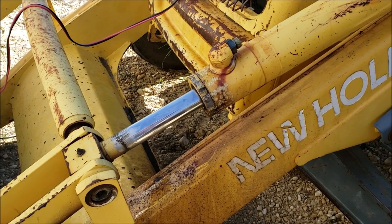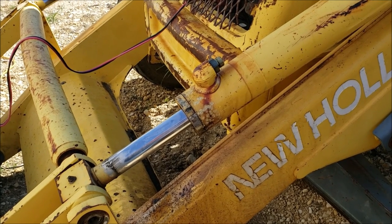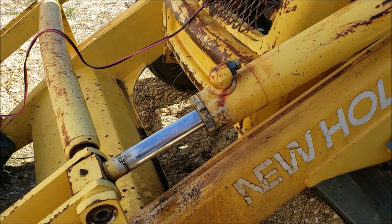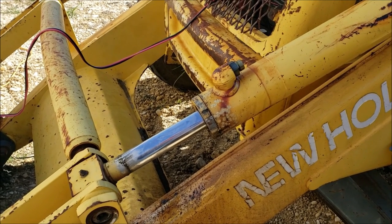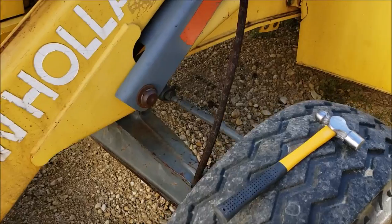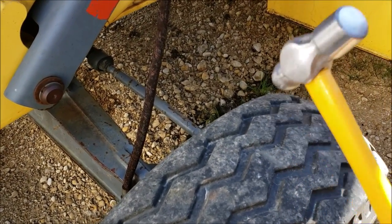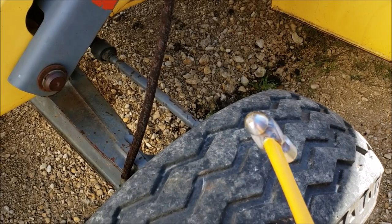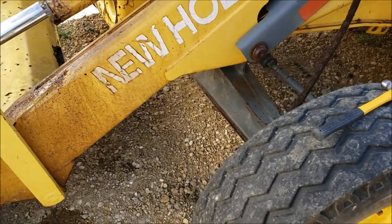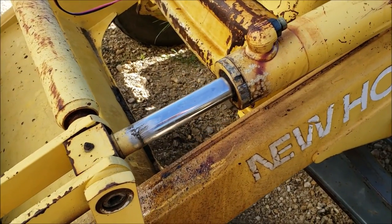I started researching to see if anybody had this same problem. Of course, tons of people have this problem. But I found one post online — this isn't my original idea — where a guy said there was the peening method. That's typically like when you're welding, you use these little ball peen hammers. What happens is when you strike a blow with the ball peen — the rounded side — it will somewhat distort the metal just a little bit and give you just a hair of breathing room, and a lot of times it breaks loose.